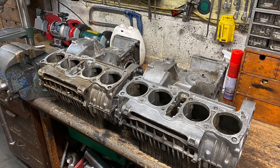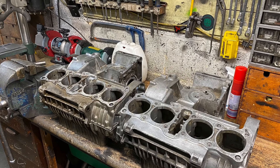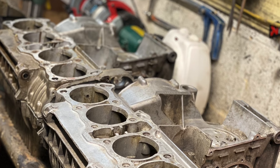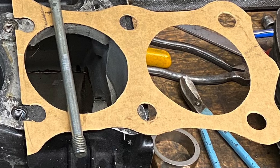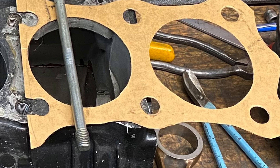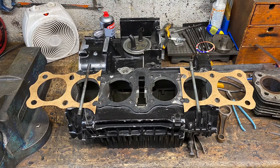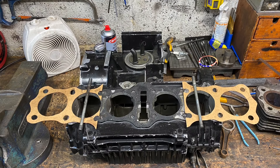The first thing I have to do is decide which set of crankcases will remain in the center and which set will be cut for the outside additions. This is determined by the amount of damage and where the damage is. I made some cardboard templates that I could overlay on the crankcases to see the external width of the engine. I was concerned it was going to be too wide but in the end it wasn't — 24 inches, which is about the same as a Honda CBX.